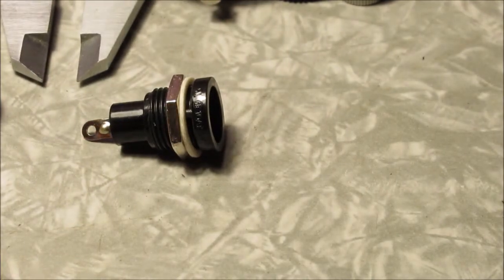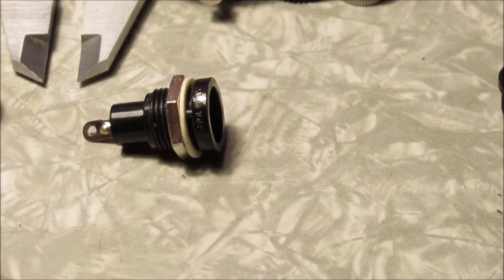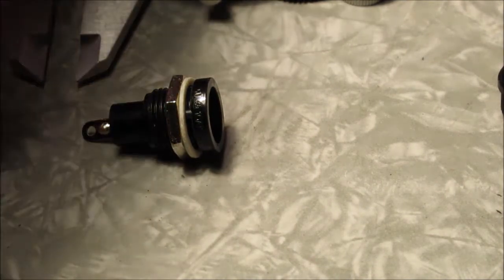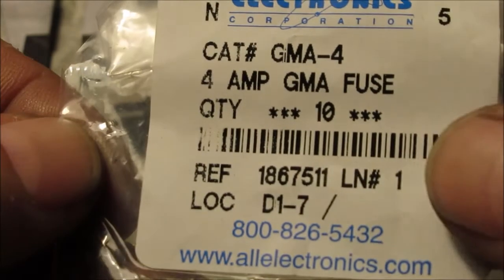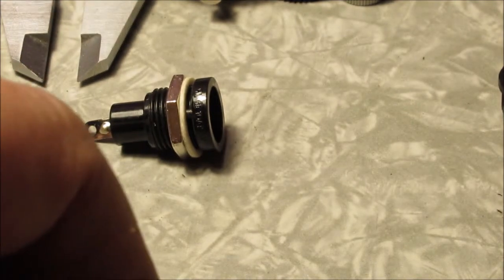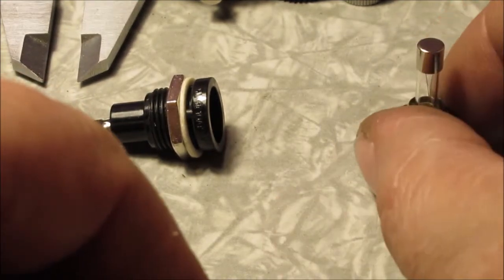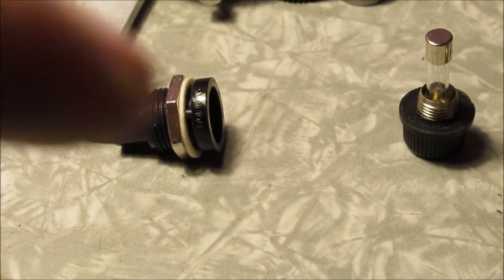Here's the new one - so I didn't mess up too bad. I'm sure the fuses would interchange, but the fuse holder was bad. These came from Radio Shack, which is no longer in business around me. I might have made a mistake - I might have said 5-amp, but I'm actually using 4-amp. I'll put in the description the diameter and length of these fuses. This is probably a lifetime supply - there's 10 of them. The reason I kept blowing fuses was I'd flip on the switch with the Dremel all the way turned up instead of turning the speed down.